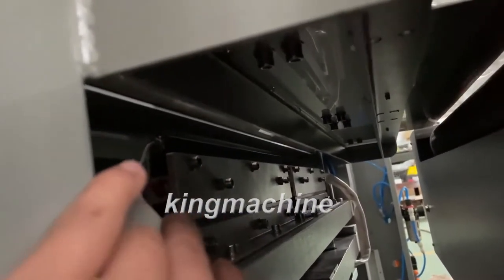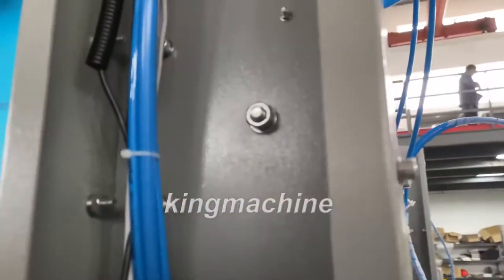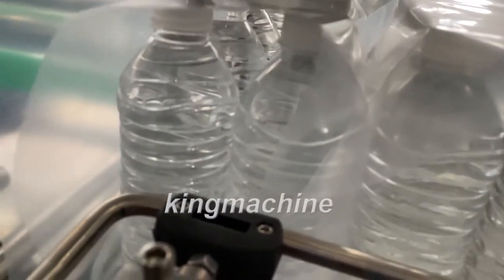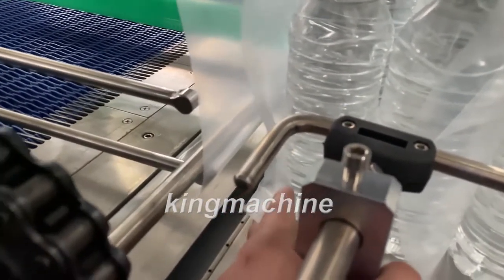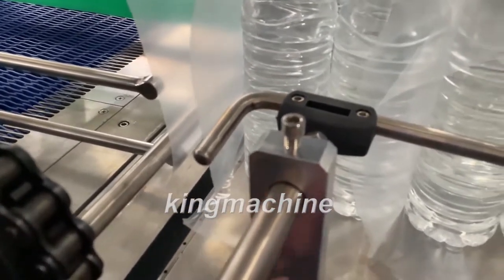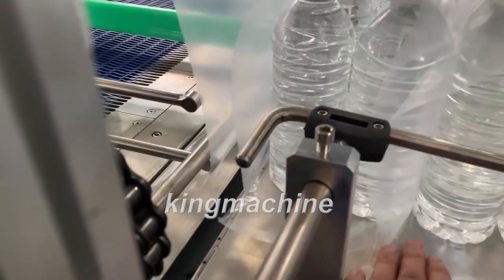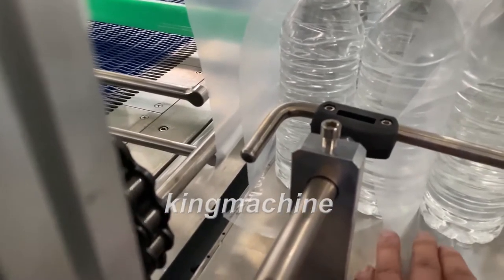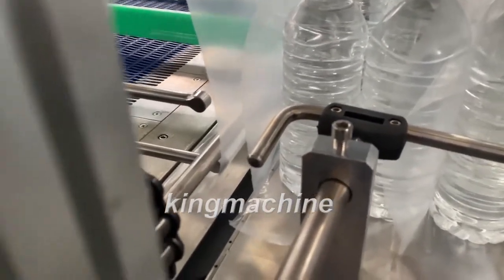This is the cutting knife — three cutting knives. When you first assemble two new rolls of film, catch the film and use this cutting knife to cut the film together. You need to pull out the two films, then click the menu on the touch screen, click menu and click the cutting knife. Then the film will be cut and stuck together.